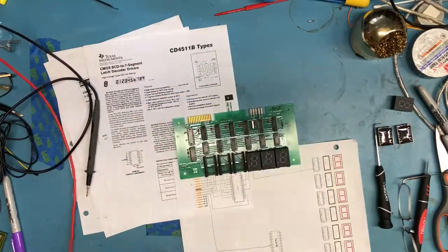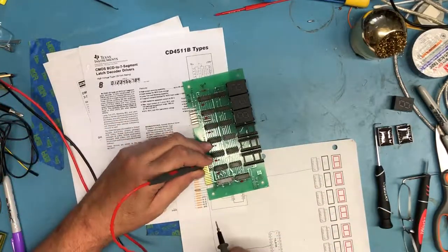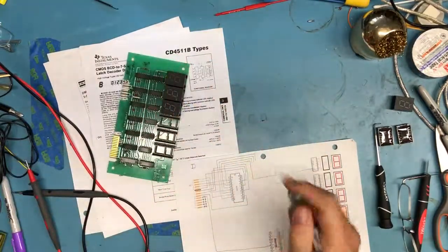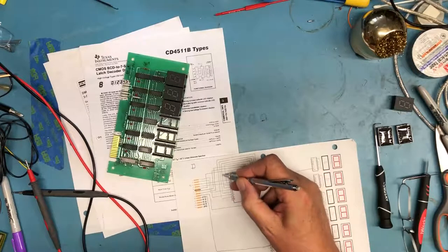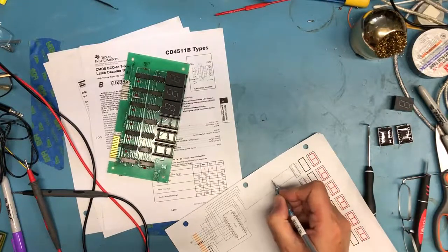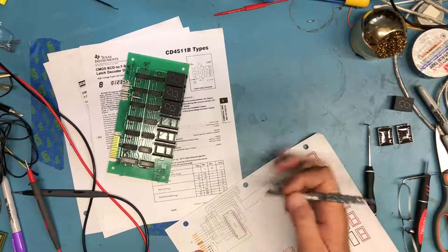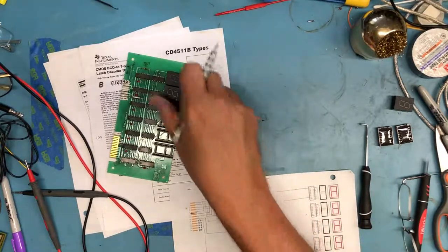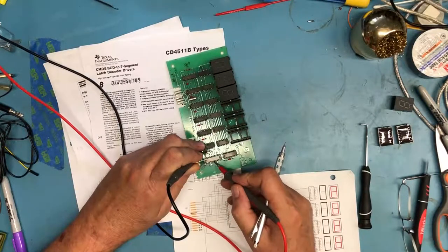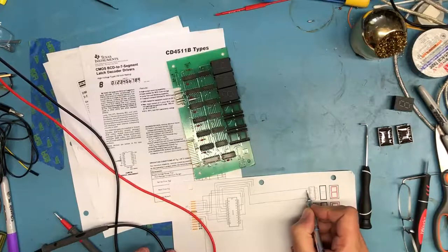Now let's go find B here. We can see that the B input, or data 1, is on pin 1. And let's just walk across again. And it's there on pin 1, 2, 3, 4, 5. So pin 5. Pin 5 is the second trace. Transfer it across. And connect it. Should probably have a little ruler here. We know the C input, or D2, is on pin 2, which is right there. And it's on pin, what is that, 7? 7 is Y3. And see, this is already making good logical sense.